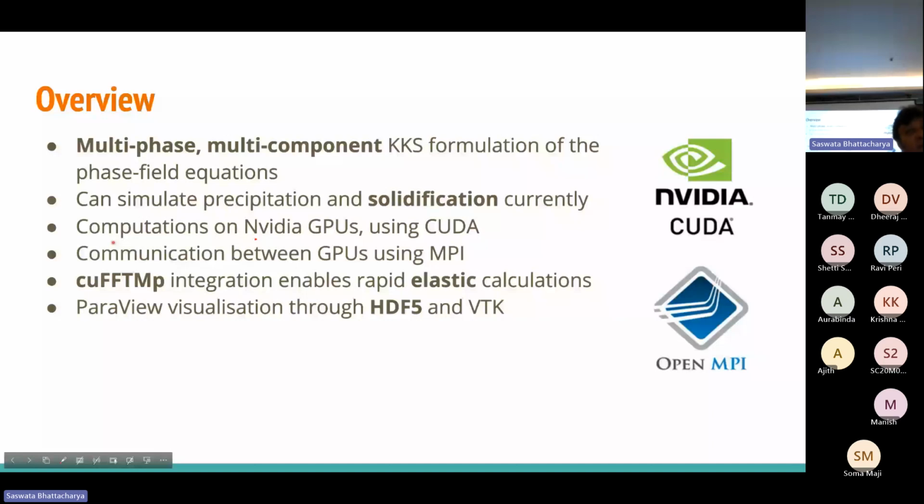So when precipitates form in the solid state, one very common example for all material scientists is aluminium alloys, where you form aluminium-copper precipitates, Al3Cu, Al2Cu. You know the sequence. Initially, these are very small copper clusters, the GP zones, and then you get Al3Cu, which is completely coherent. Coherent means lattice planes and directions are continuous. And then you go to Al2Cu, where some facets are coherent and some facets are incoherent.